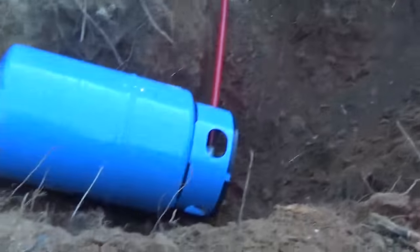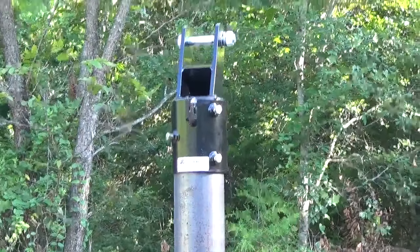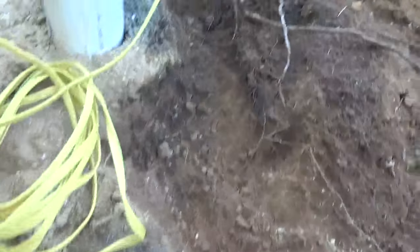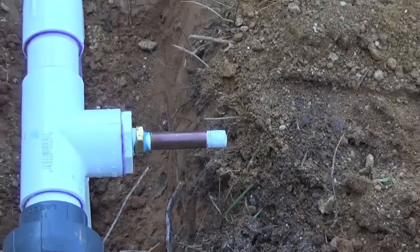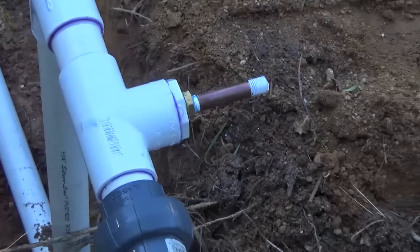I'm down here on the cistern project on the well side now. In order to control the pump, I'm going to set my CU-200 Grundfos controller up on the pole, and that is going to be controlled by a pressure switch that I've already put in line here. It's going to be a reverse-action — or reverse-logic — pressure switch, because that's what the input requires on the CU-200 controller. If you've ever done one, you know that is the pain if you didn't figure that out ahead of time, because it won't work with a regular pressure switch.